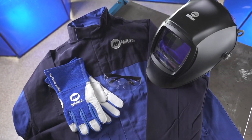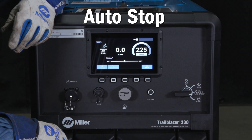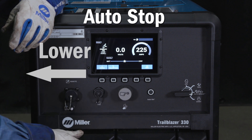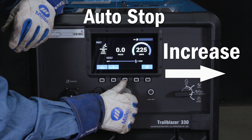Remember to wear appropriate safety gear during setup and welding. For typical non-pulse TIG welding, the advanced weld settings are either the auto stop or auto crater features. The auto stop feature adjusts the arc length required to terminate the arc. This helps to reduce arc marks from arc termination as well as making it easier to extinguish the arc. Auto stop is adjusted by pressing the knob and turning it to the left to lower the arc length required to terminate the arc, or turning it to the right to increase the arc length required to terminate the arc.